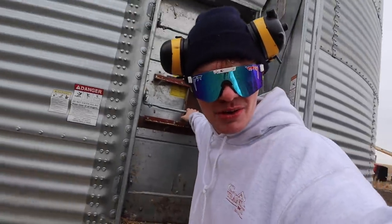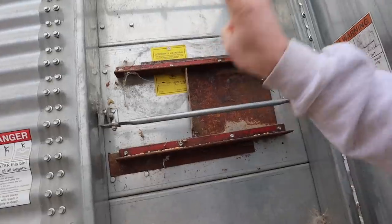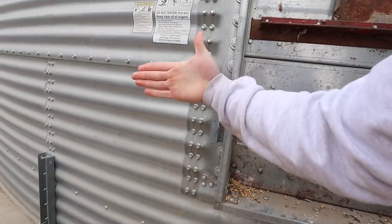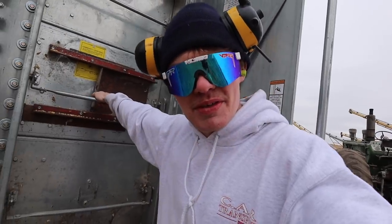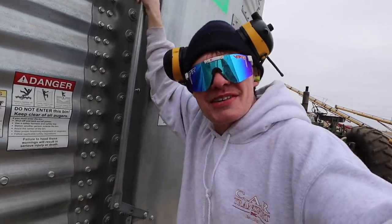When it comes to bin etiquette, you should get in the habit of shutting the doors when you get out of the bin, whether there's anything in it or not. Number one, it keeps elements out of the bin. Number two, these bin doors open inward and they swing around on the inside. If you leave these open and forget that you left them open, then fill the bin, you're not gonna get them shut. Ask Daddy Cornstar if that's a fun experience.